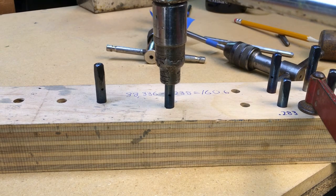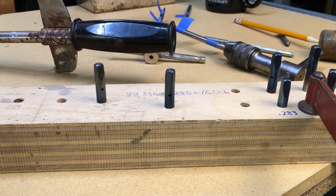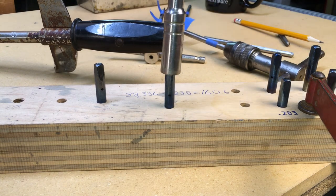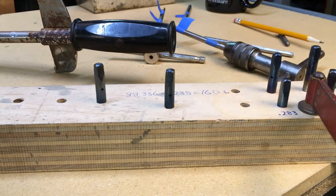This is just a simple torque wrench. But 8-9 foot-pounds translates into 90 to better than 100 inch-pounds. And that is a good pin torque, especially if you can move it small increments. So I'm pretty pleased with this. This is the type of result I was hoping for,